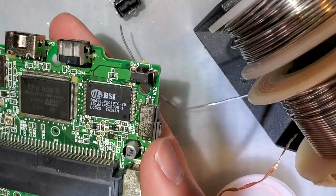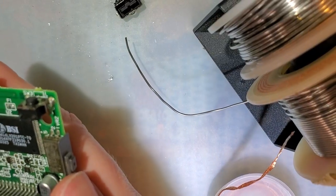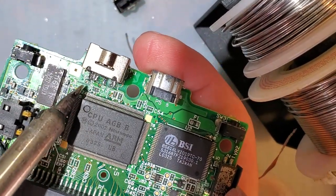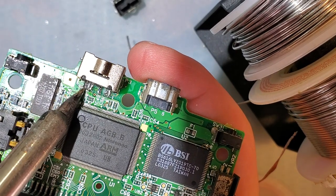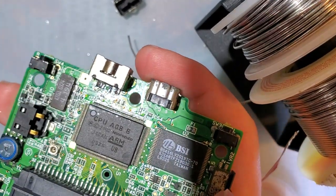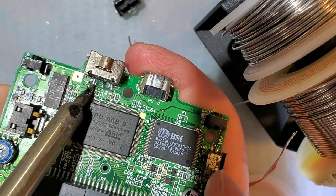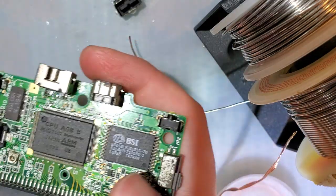But basically, this isn't the iron I was using, but I don't want to mess up my work here because it wasn't easy. I just took the iron at the very edge of the pad, just like that, and then ran a little bit of solder. In fact, with all the flux I had on there, solder just flowed from the iron onto the joint and then stayed there. And then I moved on to the next one, and then to the third one, four, five, and six.